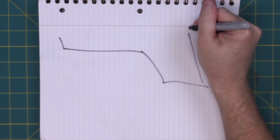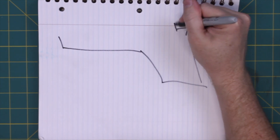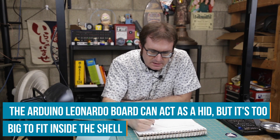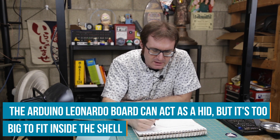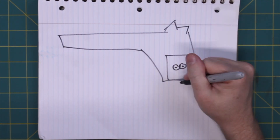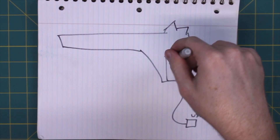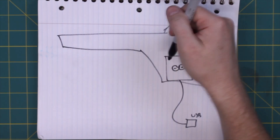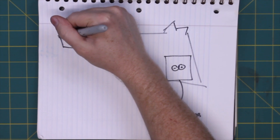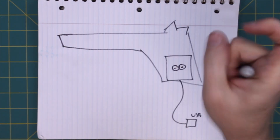I've got a Zapper here. There is an Arduino variant that can emulate a mouse or a keyboard. I've got an Arduino in here with USB out. I think what I'm going to do is make basically an air mouse, where the tip of the barrel becomes the movement of the cursor. If I put a gyro accelerometer in there on this end, that would detect barrel movement swinging left, right, up, down.